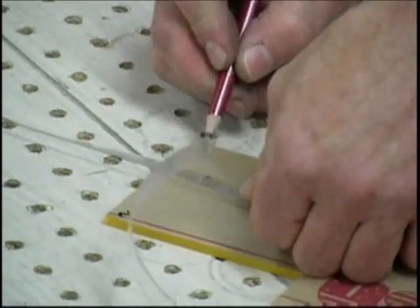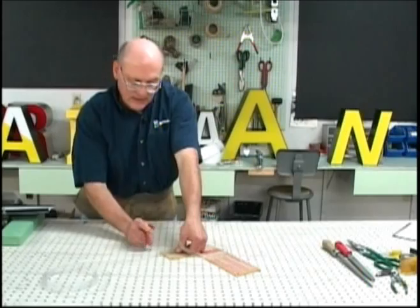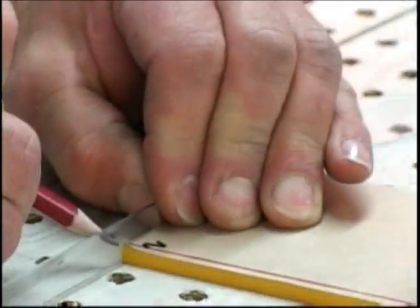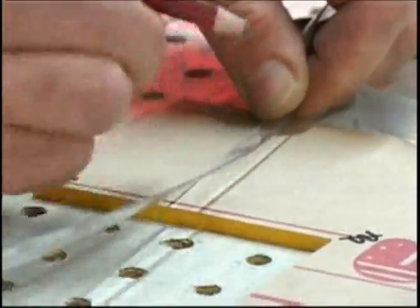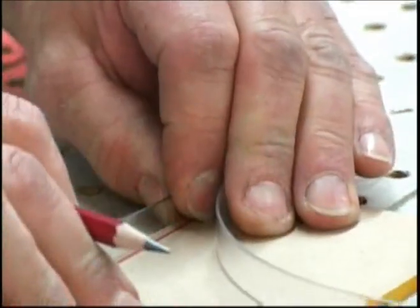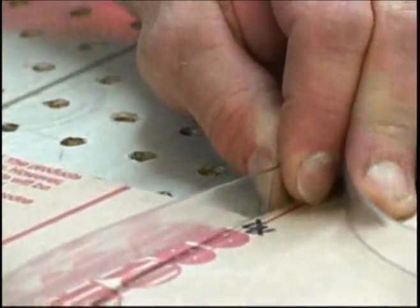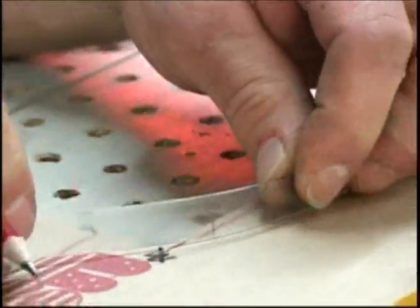and that's why we add the thickness of .040 to that measurement. I identify or transfer this mark, number 1, to my layout tape. And then we'll position again on the outside of this stroke and walk it down to position number 2, indicating that slightly past the corner, and this is number 2. On this stroke, we start slightly on the outside, and on a reverse or an inside break, instead of extending past the cut line of the letter, we're going to indicate it short of the corner, and that will be a reverse break or a bend down.